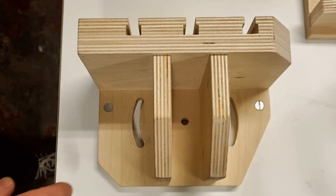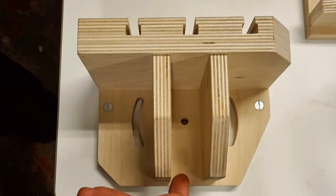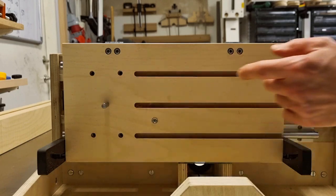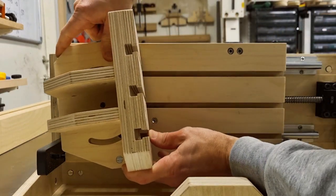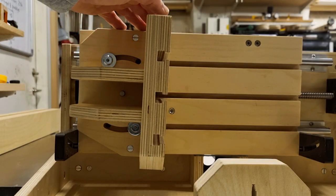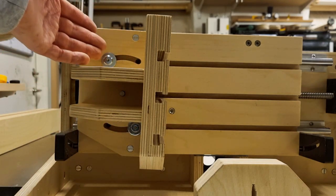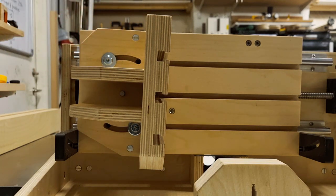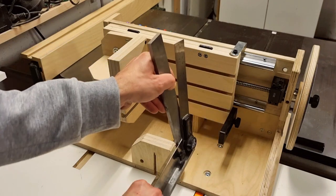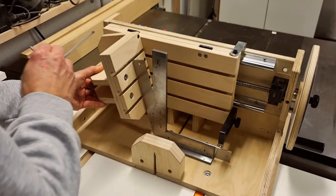So instead of dealing with all these angled wedges I found a better solution — to tweak the jig. I started by routing circular segments connecting the four holes I previously had in the carriage flange, using a center hole as the rotation point for my circle jig. Then on the carriage base I inserted a rod that fits the center hole of my carriage flange, so now the flange is free to rotate about this rod. I fasten the carriage flange to the base using these two screws.